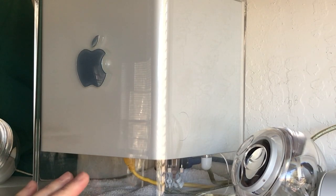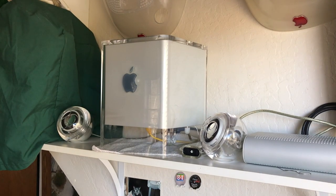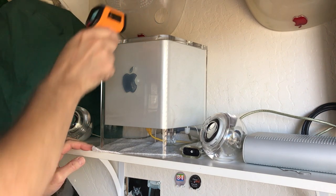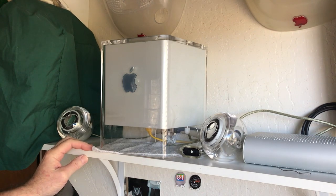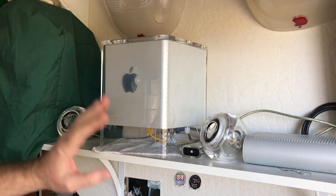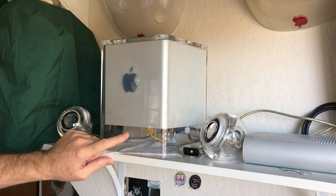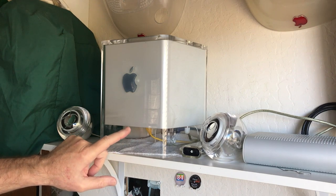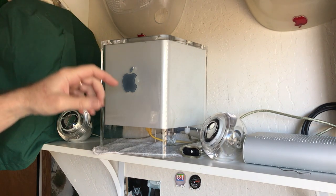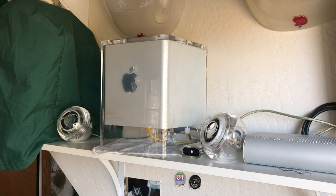That fan just kicked on and I've been using the thermal gun on it. I've been reading the temperature on the top here - right now it's down to 82, but it did get up to 89 and that's when it started to turn on. It's just barely running, just enough basically to turn it. It's working, but I'm going to try to show you a better demonstration so you can hear the fan ramp up and ramp down. I'll take the probe out - I just have it hanging down on the heat sink - and use a heat source to heat it while it's running so you can listen to the fan speed up and slow down.